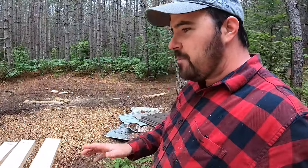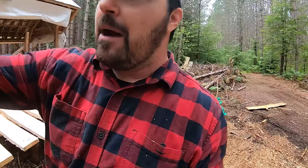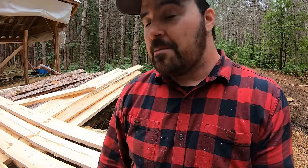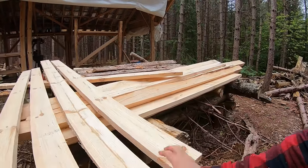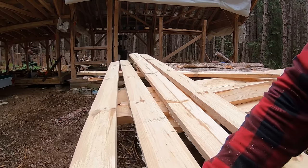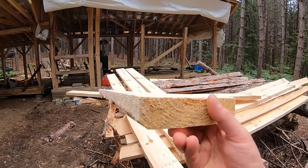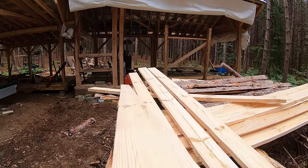Tell you guys, there's just something about putting a nice sharp blade on the sawmill that really puts a smile on my face. And I think it comes down to A, how easy it is to saw. I'm barely pushing, I'm just sort of admiring it cut. And B, the quality of lumber. These four pieces are what we just cut. On the left side of all of these boards is the old blade, the blade that should have been changed out for a sharp one prior to now. Have a look down it. You guys see the waves in there?